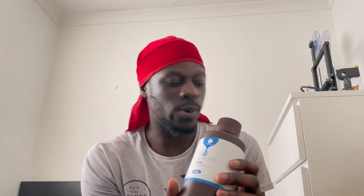You can definitely dye your resin prints. Clear works pretty well — the dye penetrates through clear quite easily. White is pretty much the same. I wouldn't recommend using dark base colors like gray or black because they're going to be harder to dye the right color. Make sure you're not using powdered dyes — liquid dyes work the best. Shake them up, mix beforehand, and then pour into your resin vat.